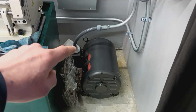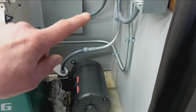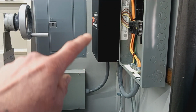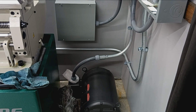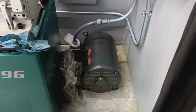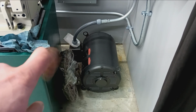Here is a temporary deal. Out of the pecker head of the idler motor, that's where all the leads are going up to the three-phase converter electrical box. What happened is there are these seal-tight connectors, which are plastic. And in the events and commotion of moving this motor around, granted it's 235 pounds, so it's a bit of a beast to move around, that connector, the stupid connector, the threads broke, pulling off the washer inside.